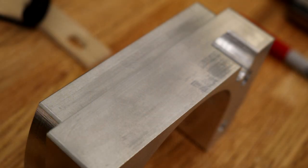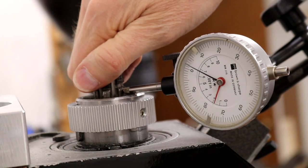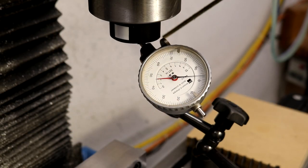Has the surface finish improved? Yes. The first improvements were seen while still using the 3D-printed motor mounts and milling the aluminum mounts. There were sides that were completely smooth, while the BLDC motor would always leave a pattern roughly 5 tenths deep — best described as what looked like the tool was rocking. At certain speeds the servo motor created a smooth cut, but not all speeds. This improvement is most likely due to maintaining a speed that minimizes the problems of a splined spindle. The PM25 spindle has two sections that are splined together — motor power is delivered to the upper half via a pulley and then to the bottom half through a splined shaft.